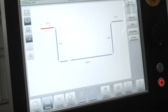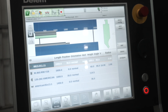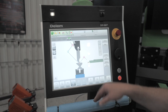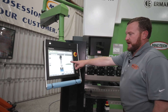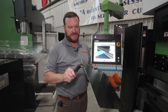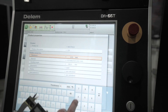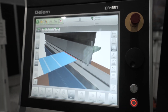The punch we have is an 85 degree 0.031 radius Rolleri precision ground and hardened punch. It's going to auto-select that punch and die, and then show us our formed part. In production, as you go through the bend sequence, the controller will show you graphically how the part is manipulated. When starting a new program, always mic your material on hand to ensure accuracy — we measured 1.43 millimeters. We edit the program, update to 1.43 millimeters, save those changes, then hit cycle start to begin bending.